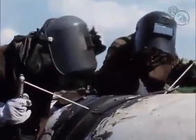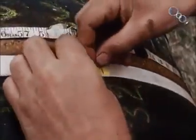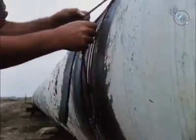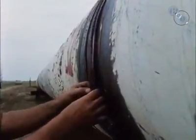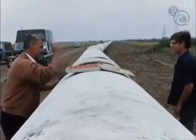Welding is the heart of the matter of pipeline construction, calling for great skill and experience. And because success or failure lies in the weld, it is most rigorously inspected. Its entire circumference is radiographed in one exposure by putting a panoramic isotope scanner in the middle of the pipe. Lead reference numbers are bound in with the X-ray film holder so that it's easy to tell if any weld is in question. When everything's ready, they take the radioactive head out of its safety carrier and set it in position, and everybody inside or outside the pipe gets out of the way of the radiation.